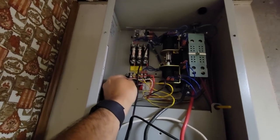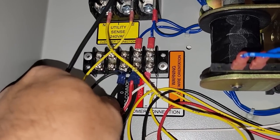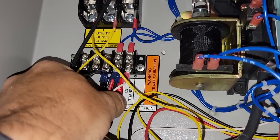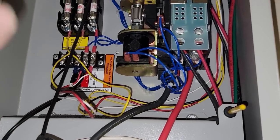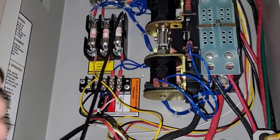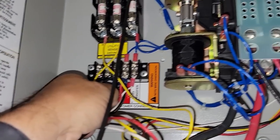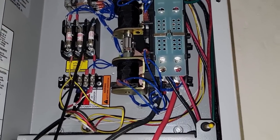Here's the power coming out. We've already measured outside to see if we had it. We got one leg — it's on zero, which is the nature of the common negative terminal. And the other one is on the 12 volts positive. Your transfer is your 12 volts coming back — or I should say it's your negative voltage coming back to energize it. What's really weird about the way the generator people wired their thing is they wired switches hot with 12 volts, and they switch the ground on and off to take it one position or the other. So the transfer switch here is actually a negative — it grounds, closes the circuit to ground to power the solenoids. Now this is 230 volts in here — 230, 240, 208, depends on where you're at.